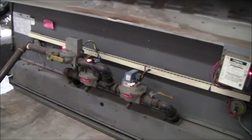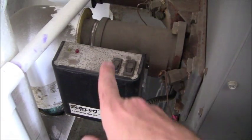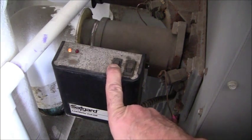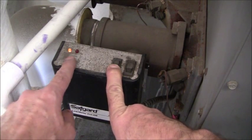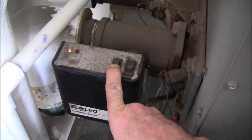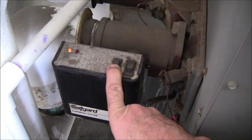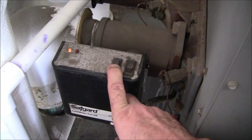You can see all the lights that are on. Now we're going to go back to the low water cutout. This time I'm going to hit the test button again — the yellow light came on and the boiler shut off, I could hear it. But this time I'm holding this button down for 30 seconds, and then we should go to a lockout.